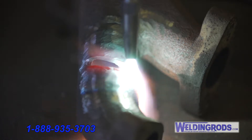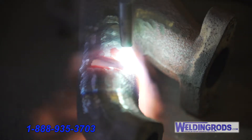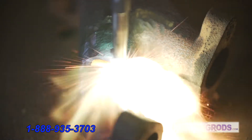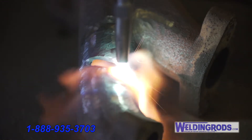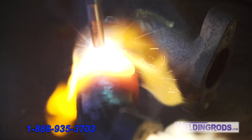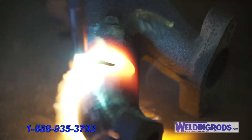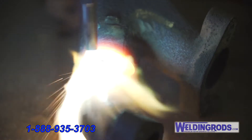Cleaned up and we're going to spray with cast iron spray powder — take a look. Now this process takes time, it's not something that you do fast. You've got to take your time with the cast iron and slowly spray that hole in, and it'll slowly start to seal itself up. But you have to get the cast iron manifold up to temperature, and once you do, it gets a little wet looking and then you can start to add the powder. The torch is filling in this hole in the manifold and it's really starting to repair and seal it up. You've got to be very careful because you're getting the manifold cherry red and it's very liquidy, so we don't want it to fall through.